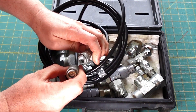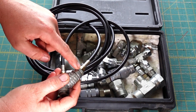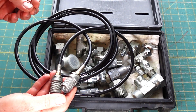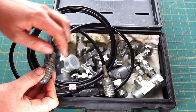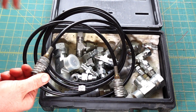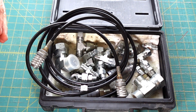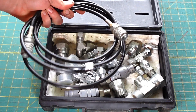These are the Parker-style PD couplers. I use the females on the hose. Some people like male and female, and some people like both male — it just depends on how your gauges and test rig are set up. For me, the gauges have males and the test rigs are males, so it's better to have the hose like this. You can get these couplers from CAT, John Deere, PD, or Parker. I put a link in the description for the Parker Quick Disconnect catalog which has these PD couplers.